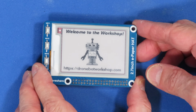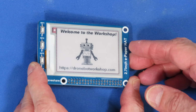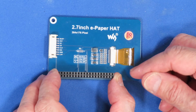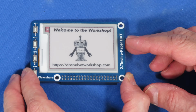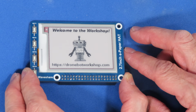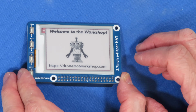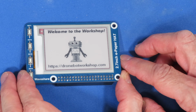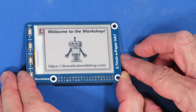Now you'll also notice my display already is displaying something, and it's displaying this cute little robot over here, and I don't have it connected to anything at the moment, and no, there is no battery on the back here, there's no large capacitor to hold the charge. This is actually just displaying the last thing that I wrote to the display, and that of course is the nature of e-paper. It holds the last thing on the display, and until I write something else, it's going to continue to display this. And incidentally, if you're curious as to how I wrote this, well, just keep watching the video because I'll be showing you that later. But there you go, the Waveshare 2.7-inch e-paper hat that we'll be using in today's experiments.